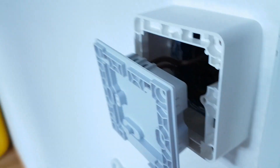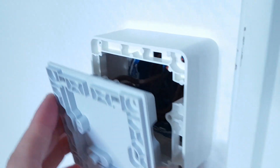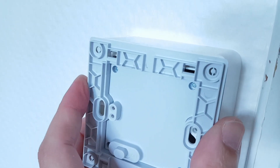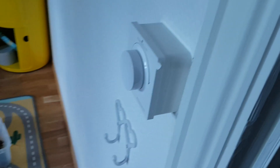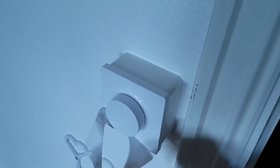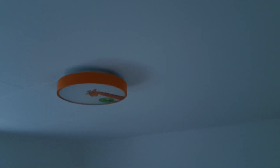Alright, that's it. Connected the switch box to the cable in the back there, and that went well, no issues there. Now I'm just going to screw this back into place and put the lid on. And that's it — it's not the most beautiful solution, but it works. And it allows you to use the dimmer switch with the lamp. Now I have to go put the main breaker back in, put the power on, and connect it to the lamp in the ceiling.